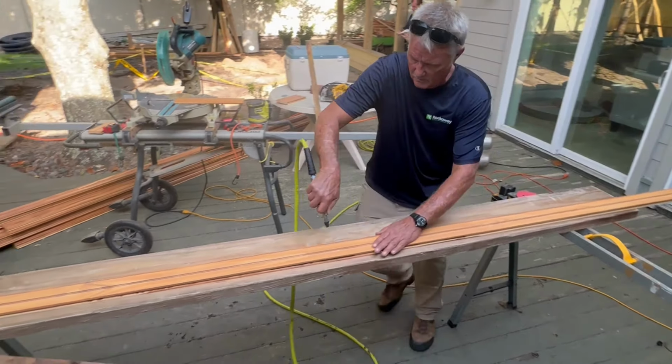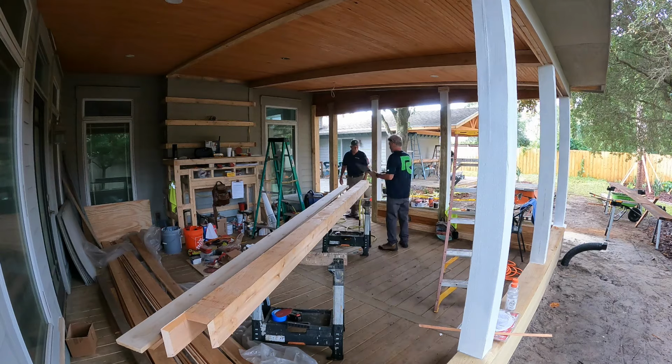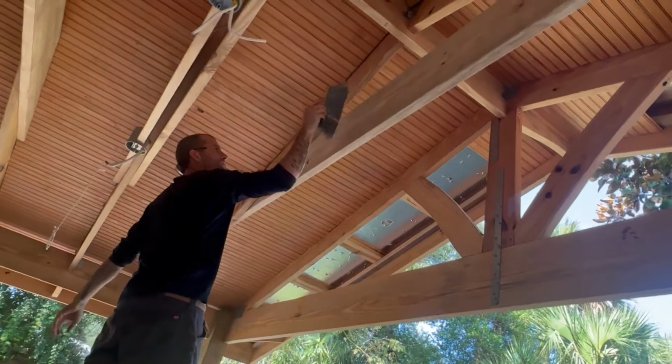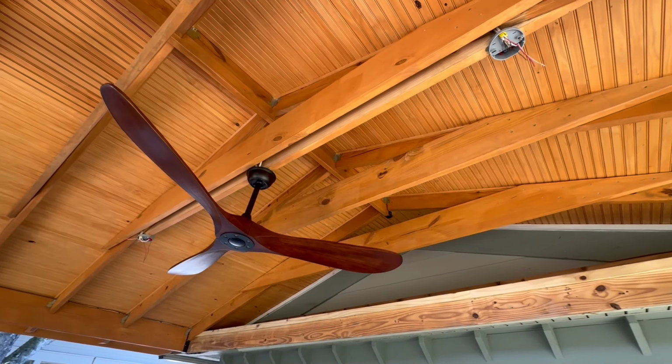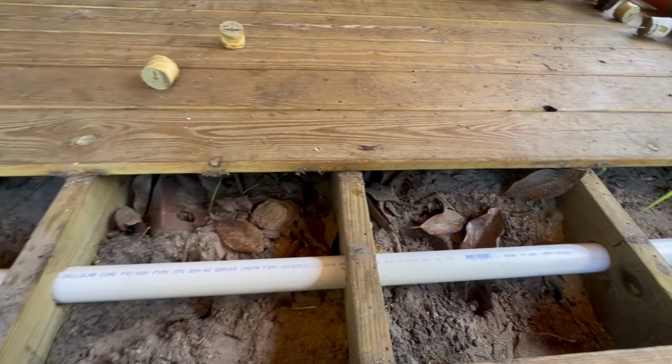And the interior walls are 1x6 tongue and groove, so we literally build it on the ceiling as we go the entire time, nailing it in so there's no nail holes. Put a little bit of quarter round around the joists. We have collar ties all between, to code, what they asked for. And we're gonna be having lights hanging down and a kitchen in this area with plumbing and electrical. And it's gonna all be an open design.